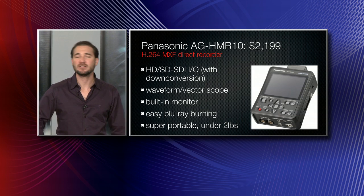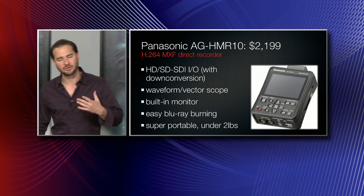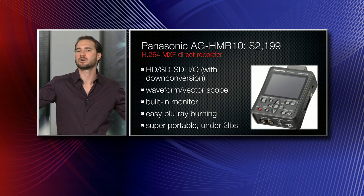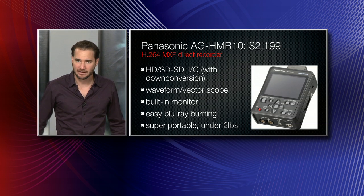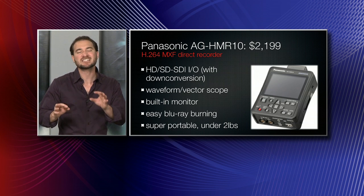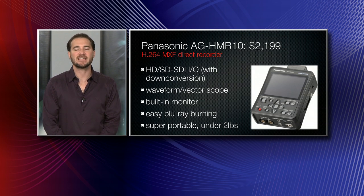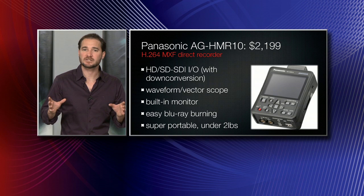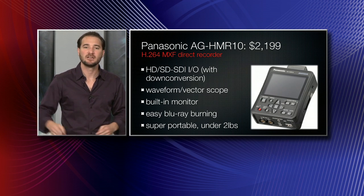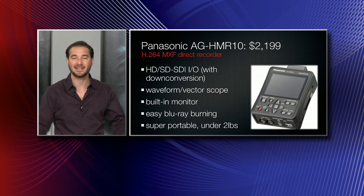Why is that nifty? Let's say you're at Art Basel and you want to record an event and immediately turn it over to YouTube — you don't want any delay. You're in the field with this battery-powered device. It works on your camcorder's batteries; pop them off and stick it on here. You take an HD-SDI signal in, dial the bitrate down to six megabits per second. That's the lightest proxy-level AVC cam HD codec — so you're recording H.264 high definition, 1920 by 1080, at six megabits per second, getting very light compressed files.